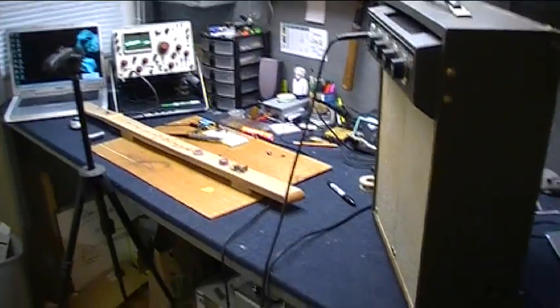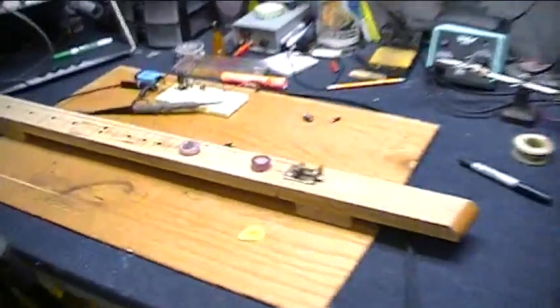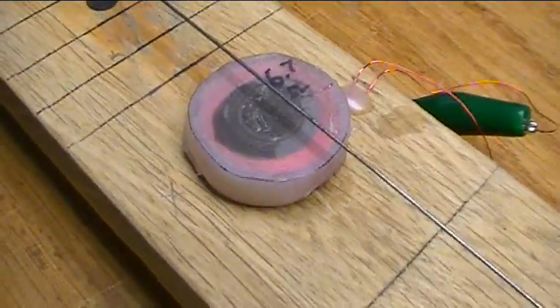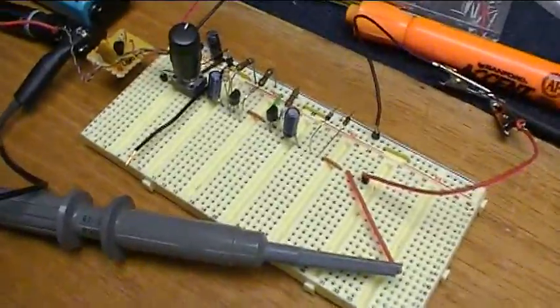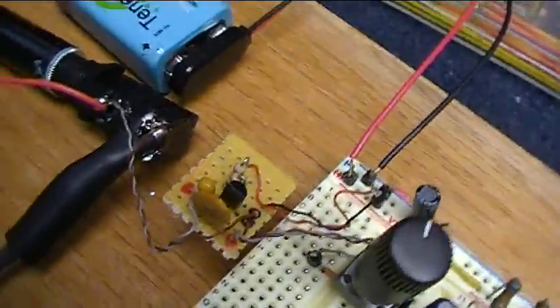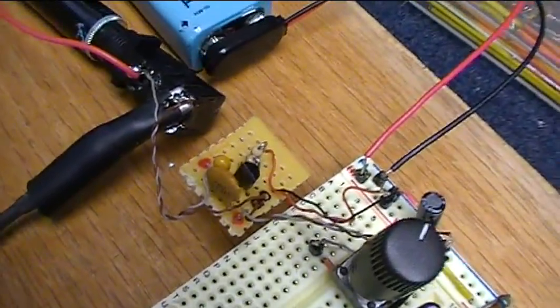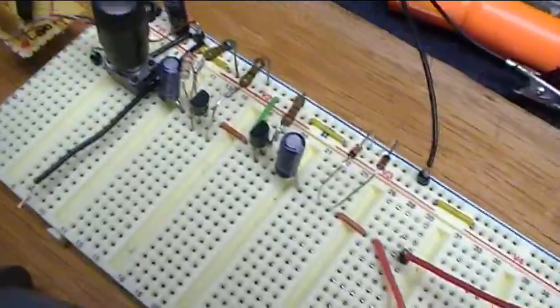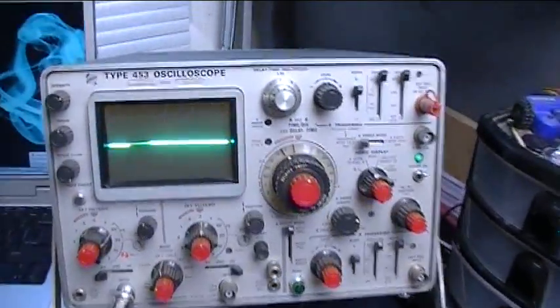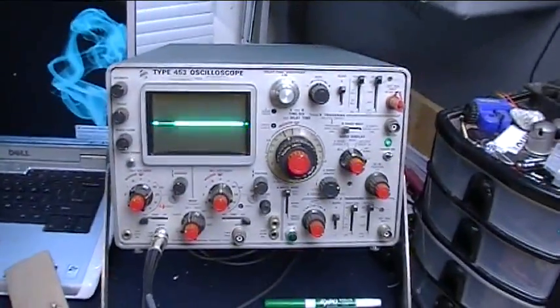Here's the setup I've got going on at the bench to test this thing out with. I'm using the old diddly bow I made from a hack last summer where I made the homemade pickup. That's running onto the circuit here on the breadboard, and right there is the little single-transistor pre-amplifier wired right in. That section there is the two-transistor amp that creates all the distortion — there's those two diodes. Got the old Tektronix 453 scope fired up, and it still works great.